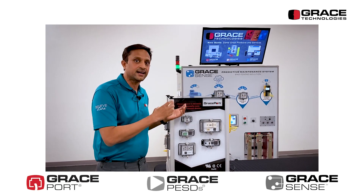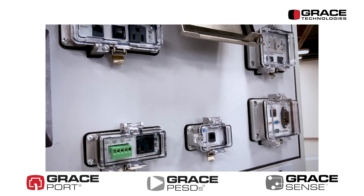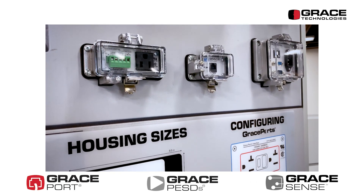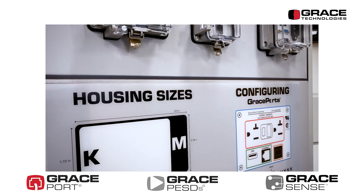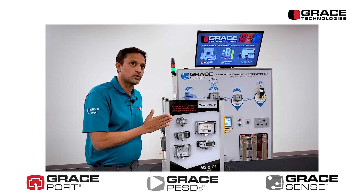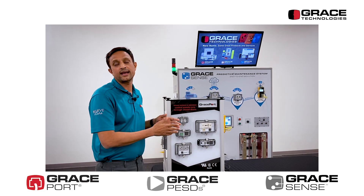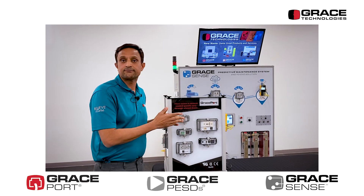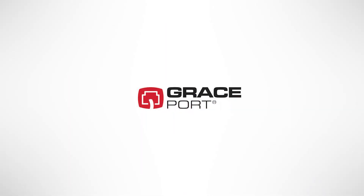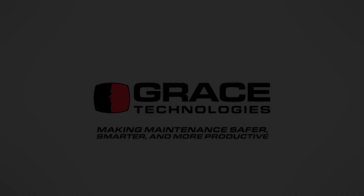If you use anything inside the panel, UL 508A does not require it to be GFCI protected. But anything used for accessory equipment must be GFCI protected. By using GRACE panel interface connectors, one can safely meet the requirements of UL 508A and NFPA 79, and further enhance worker safety and productivity as well.